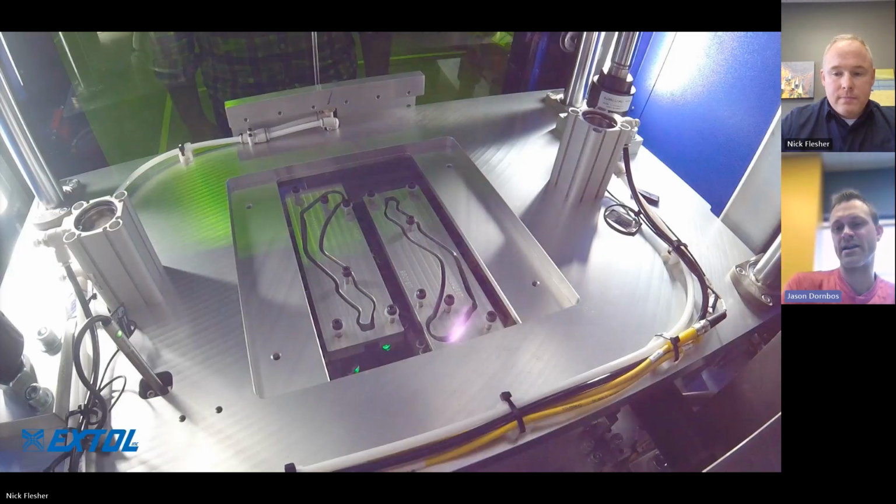Great question, Ron. Yes, during the cooling process, we maintain clamping. You have to keep holding while those materials are cooling down so that they form a strong bond. And I'll go so far as to say that clamp pressure, we actually have 2 different pressures in our process, is really critical. We've seen situations where maybe there's a hard stop implemented, as we like to call it, either within the part or within the tooling, and that's not acceptable.